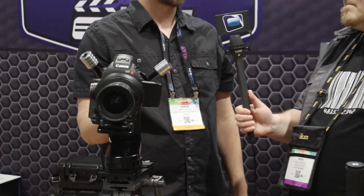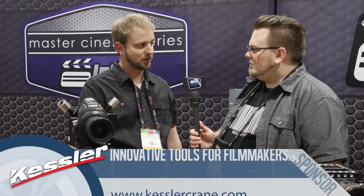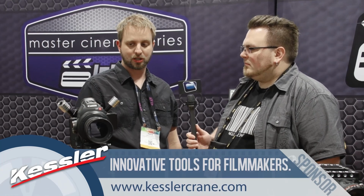The benefit of that is we can get away from the stepper motors because we don't need the torque anymore, so we can go to a brushless motor. The beauty of this is that with the brushless motor, we can still do the roll shot it was originally designed for, but it also lets us do the stabilization the Steadicam guys wanted. They wanted the auto horizon, and the brushless motor is fast enough to keep up with that. I know you're familiar with this because you're a gimbal guy. Exactly. This has an 8-bit controller in it, but the final version will have a 32-bit controller with Bluetooth, joystick control, all that goodness.